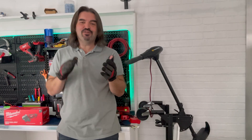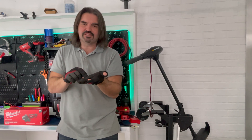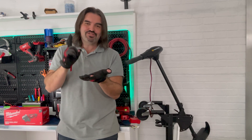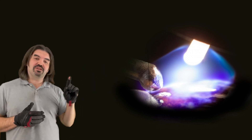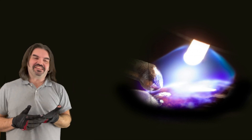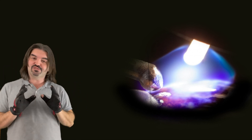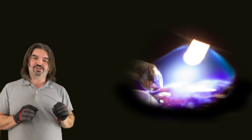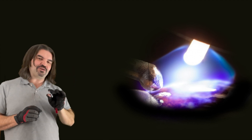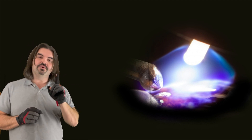I couldn't avoid the problem because I couldn't see it. Of all the hundreds of welding videos that I watched on YouTube, none of them showed me how to visually recognize the moment the problem happens. They all told me that there would be char marks around the arc, but no one told me that if you're looking for those char marks, that's actually a mistake. Here's what it looks like right before you tip the tungsten, and I'm about to show you what it looks like two seconds after you tip the tungsten. Did you see it? There's nothing to see, because all around the arc all you can see is black. When you've got the helmet on, you can see hardly anything, especially if it's a dark color like black. So there's no way to spot that char, but there is a way to spot something very subtle right when the tip happens. There's a very slight shift to the color violet right in the middle of the arc, and if you can key in on that color shift, then you have your cue that you've just tipped the tungsten.